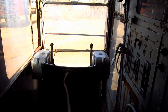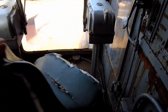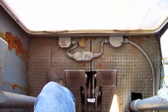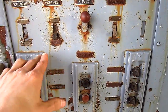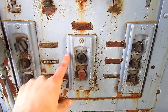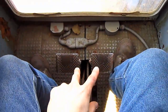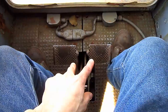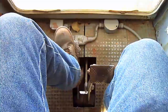Now let's go inside and check out the operator's cab. From here you can get a good overview of the inside of the operator's cab on the 4161. Off to the right side on the control panel you can see all of the switches to work various functions on this machine, such as the hoist brake, the propel hoist, the steering, the main start switch, a switch to control the propel clutch, the swing brake, and the boom hoist. These two foot pedals directly in front of the operator's seat control the swing function — the right pedal swings the shovel to the right and the left pedal swings the shovel to the left.